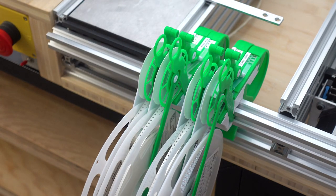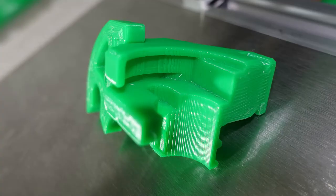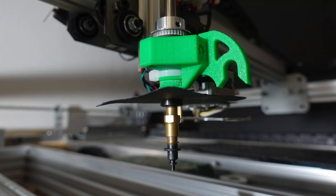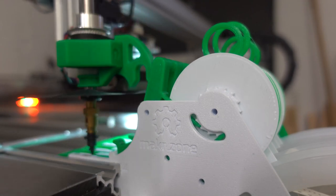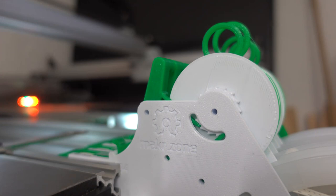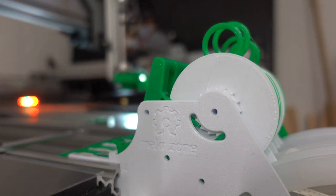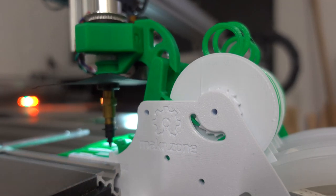Now let's have a look at the underside, the spent tape chute. You can also parameterize the bends for your table. And there's also a 3D printed adapter for the light placer users. All you need is a zip tie to get started. Other users can use aluminium bracket or something. The geometry of the lever actuator is very simple. Here you see the feeder in action.